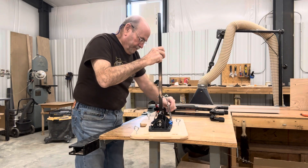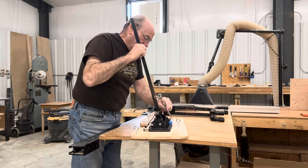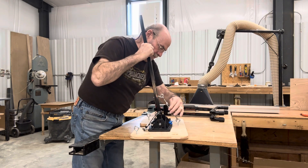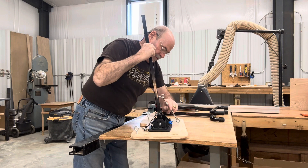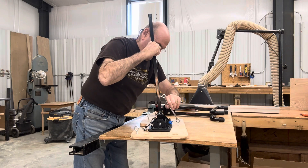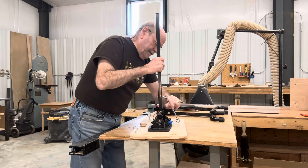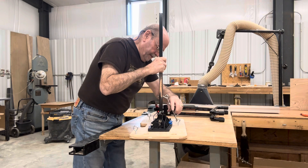This one can have a little play in it, so you'll probably have to pull your pins back out so this is free, and then hook your eye bolt hook into that, pull it up. Go ahead and tighten this up — make sure it's pulling your T back to the center. Tighten going left, and just get it to a point where it can stand up, then put your pins back in as long as this doesn't fall totally out. Continue tightening, get your feather pin in, and you're ready to go.